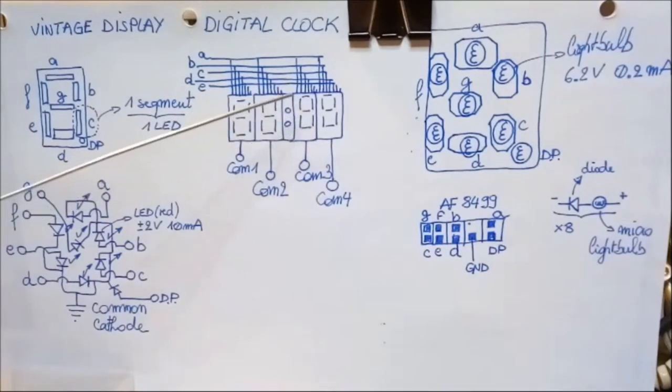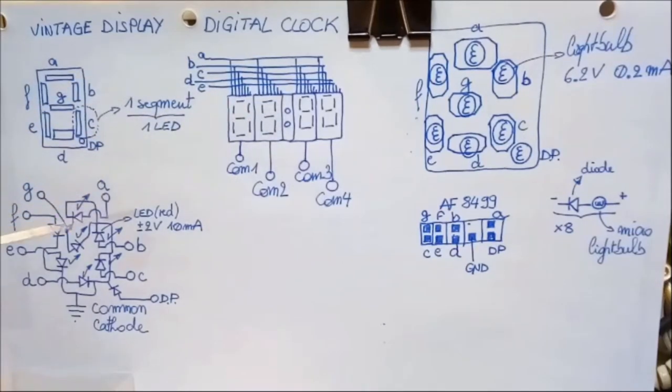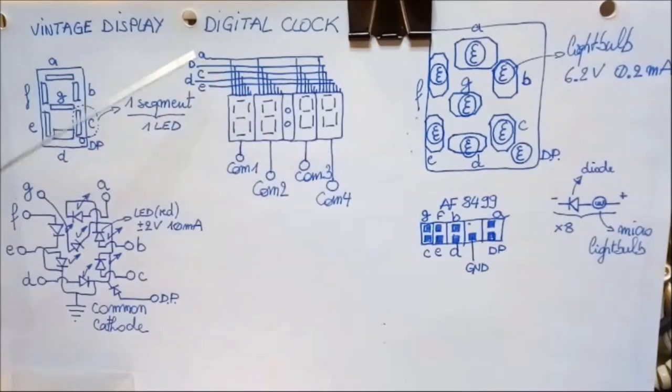Now, this is actually wired up exactly like this, with only one difference. That is that you'll find 3 extra pins, namely a common cathode for each display element. Okay. Often the separator points have a common cathode which is either connected up to one of the number elements, or in certain cases it does have its separate little common cathode pin, and then you would need not 3 but 4 extra pins. But this is largely how these things are connected.